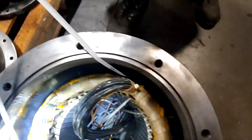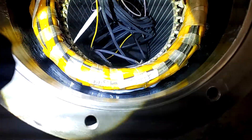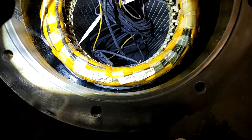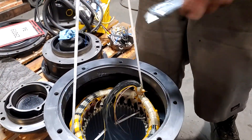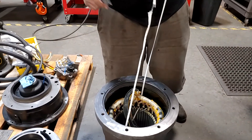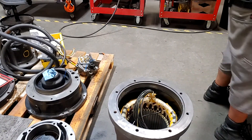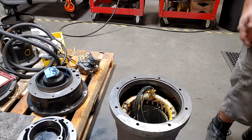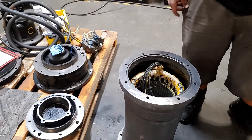This is a much better epoxy than what we used in the past — we're getting a hundred percent coverage instead of just a portion, and it's locking it in nicely. We've put the stator in. There's a 24-hour cure time on it, so do it today, come back tomorrow, and after that 24-hour period we can start reassembling — especially if it's the smaller ones that you'd be moving around.